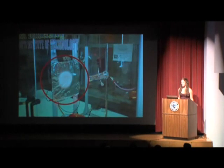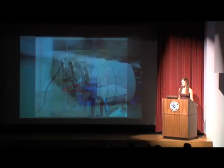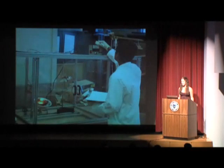Once you have set your experimental parameters — such as distance between the collection plate and the charged polymer, angle of the polymer solution, the type of polymer, and its mass percent — you can then turn on your power supply and slowly adjust the voltage from 0 to the desired maximum voltage. The standard voltage to electrospin most polymers is 1,000 volts per centimeter. So if your distance is 15 centimeters, you would need approximately 15,000 volts. This much voltage is necessary to break down the air between the solution and the collection plate, because air is a natural insulator.